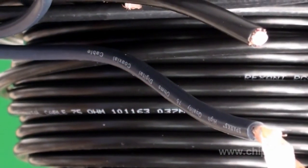Cable with wave resistance of 75 ohms is the best to transmit television signal. Losses are also an important parameter of radio-frequency cable. You can just remember that the thicker the cable, the lower the losses. Therefore, if the antenna is located at a great distance from the TV, it is better to use large diameter cable.